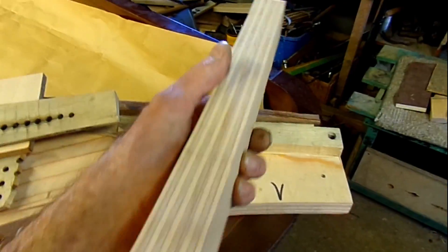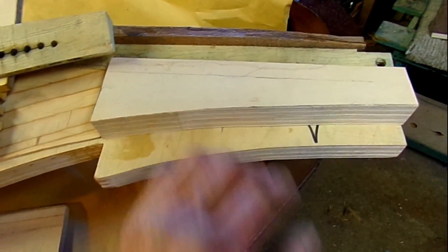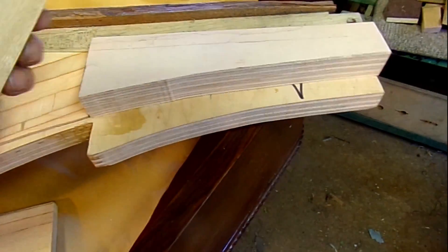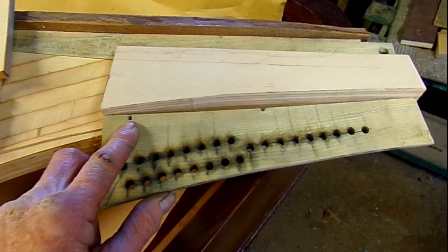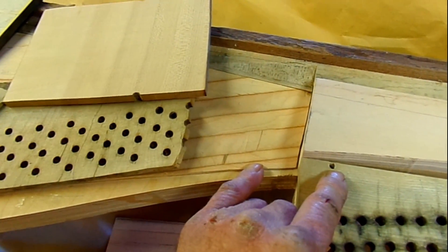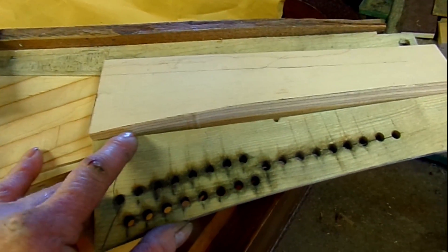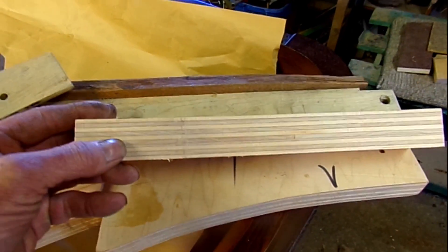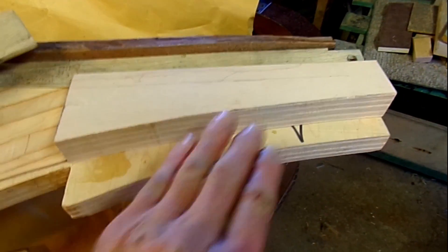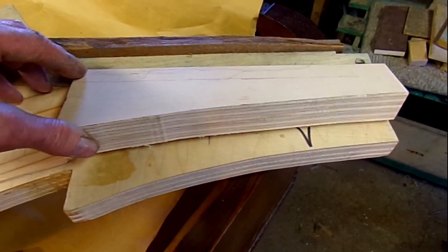So we're going to replace this piece with this multi-laminated maple block. We've got a lot to chew off here — that thick. I did this over here with a chainsaw — I didn't show that, but it worked really well. Because this wood is very difficult to machine off — it's stubborn because of the grain direction changes in the layers. I think I can pass that through the bandsaw though. It has to be made this thick — thin here.